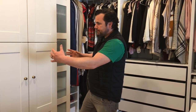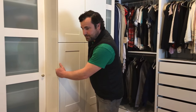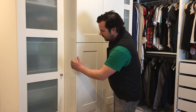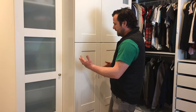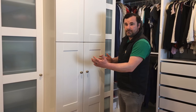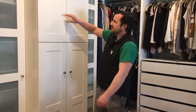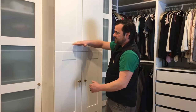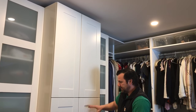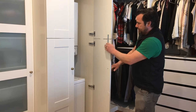Once that was all set in stone, I could actually make room for this laundry unit. Inside, the washer and dryer are 24 inches wide, 24 inches deep. What I did is I actually bought two fridge panels — 36 by 96 inch Forbatra off-white panels for your kitchen. I have Grimslov off-white doors, and basically it's from a pantry unit that's 90 inches tall, 30 inches wide. This is a 15 inch wide, 40 inch tall Grimslov door, and a 50 inch tall — just the same thing, designed for a pantry unit.